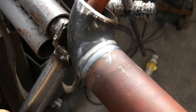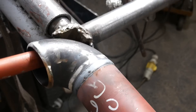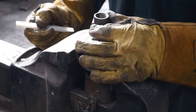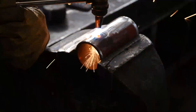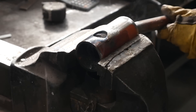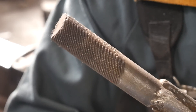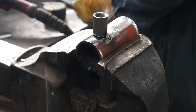Once that's done I put it to the side and work on putting a socket on the sleeve. The purpose of this socket is to be a drain to capture any leaks that come out of this piping pipe system. Once I burn the hole I clean it off with my linisher so I don't weld over any slag. Then I use a file that's been snapped with a hammer so it leaves a sharp edge, so I can clean the inside of the pipe to get rid of any burrs — you clean the burrs off so it doesn't affect the flow rate.